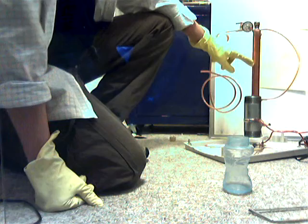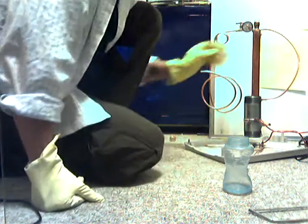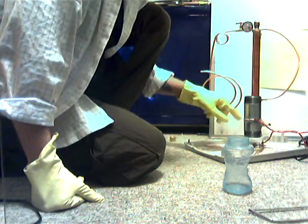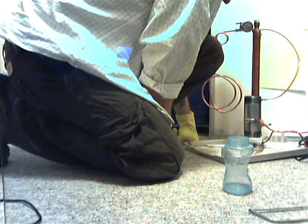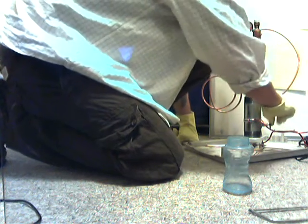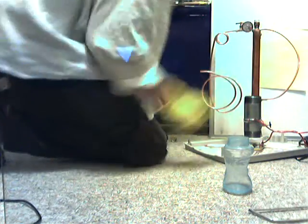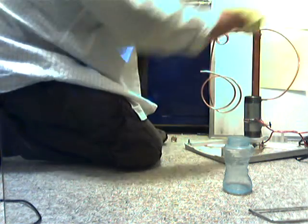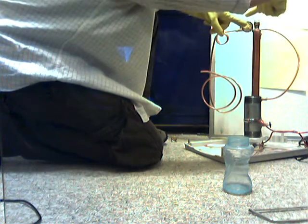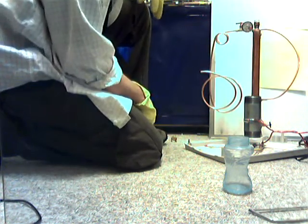This tank here is a water tank I've added. It'll allow me to enable a trickle into this tank, and this tank holds a perfect amount to run inside this cylinder. The hose comes down and goes just underneath this hose, so that if water does shoot up the hose it'll spray back into the tank. I only want steam coming out of this line, not water.